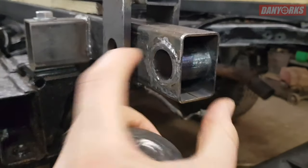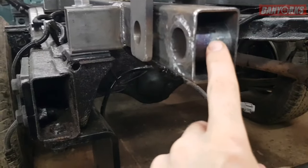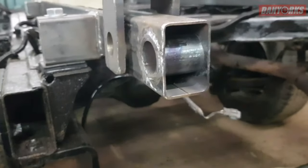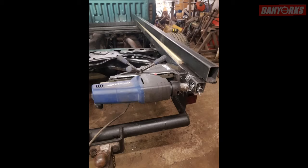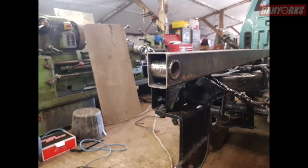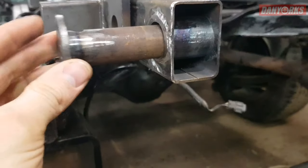What I've done is take a piece of tube that's slightly bigger than our pin. Here we're using a mag drill and a 33mm rotabroach bit to drill a hole right through the box, which enables us to insert our piece of tube right through. Then we can weld it on both sides, and that will house the pin nice and securely.